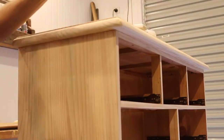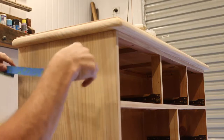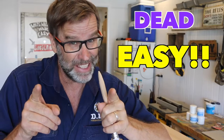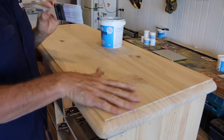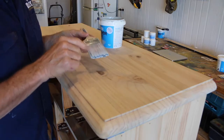The top of the dresser is going to be light grey, and the side and the front are going to be white. To apply the paint, it's dead easy and anybody can do it. All you really need is a half-decent paintbrush, and the beauty of the paint is that it's water-based, which means to clean up, all you need to do is wash it out in water. Now we'll do the top first in the light grey, and just remember, don't lay it on too thick because the thicker you do it, the less transparent or translucent the paint's going to be.